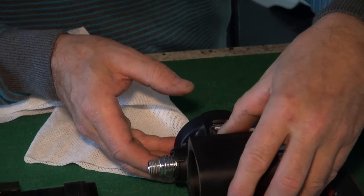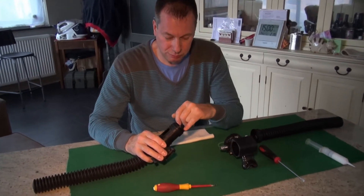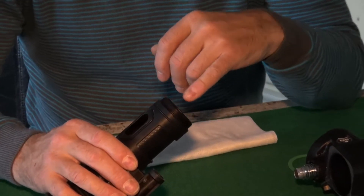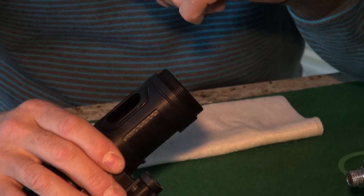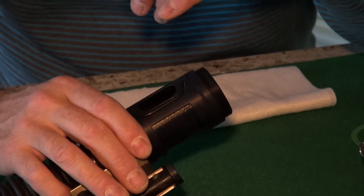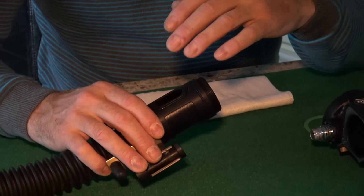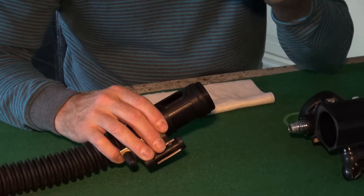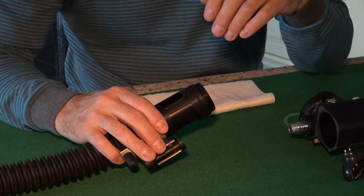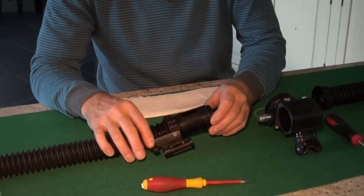On removal of the barrel, you'll notice there are no mushroom valves in the ends of the barrel. The Aurora has a special valve assembly built inside the inner barrel — an angled valve. This cannot be removed by the user and remains in position for the life of the DSV. The flappers can be removed, but that is a separate service to be covered another time. It's not difficult, but requires a little more care than the normal way to change mushroom valves.